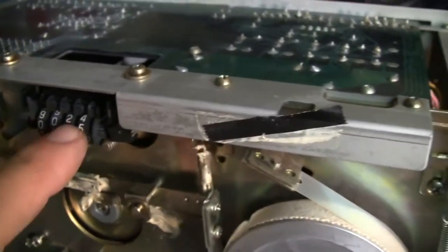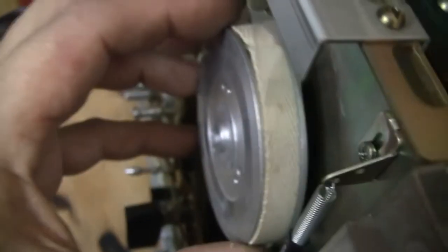And I lubricated everything. I did go ahead and change the counter clocks belt. It was fairly simple. All I had to do was take off this top panel here, and then I could get inside there and take out the belt from this side. And then the tricky thing was to move this until there's screws there. Watch, I'll spin it. And then unscrew that screw there, and this one as well. And then this whole thing comes out. And when it comes out, there's a wheel in which that belt sits on. And so that's how you replace it. So you feed it back in, loop it across here, put it back onto that little pulley right there. Nice and dark in here, right there. And good to go.